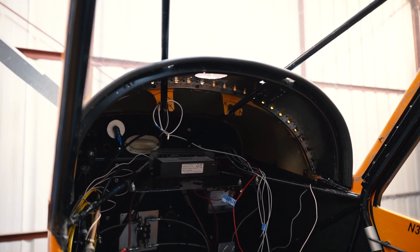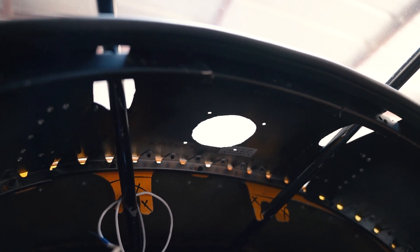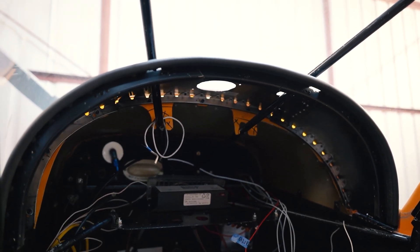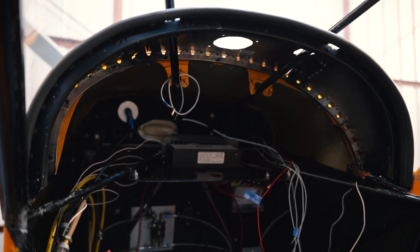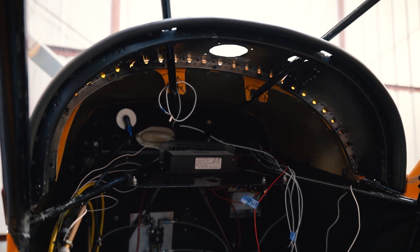We're back. Another day, and another dollar spent. So I'm going to show you guys what I did yesterday. I finally got the dash installed. That hole is going to be an exhaust fan port. What we ended up doing was cutting that frame in the back — that mounts the boot cowl — into three pieces, cutting the dash part into three pieces, and then cutting this panel mount frame into three pieces. All this to prevent taking the windshield off, which hindsight 20/20 would have just been easier.